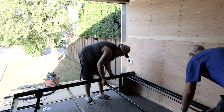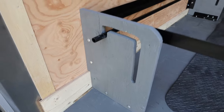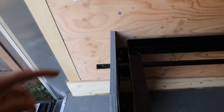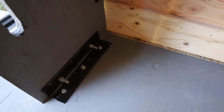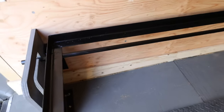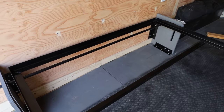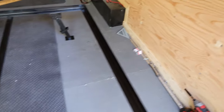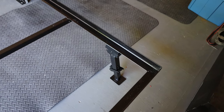From the sleeping position, lift it up, drag it back, and it's locked for sleeping. You can see the boards and bolts - we'll do angled triangle-shaped shelves on the top that will also support it. Each piece is bolted into the wall - make sure you hit a stud. The tube acts as the hinge and runs from one side to the other, welded in place. The bed is 75 inches long, giving enough room to walk around. The leg is a tent trailer leg so you can extend or shorten it, and it swings in. On this side I had the wheel well so I put those bolts out a little bit.